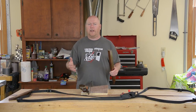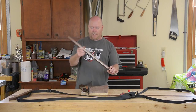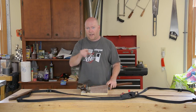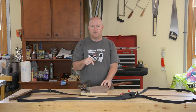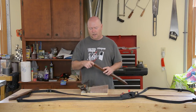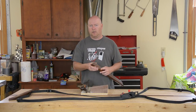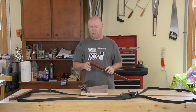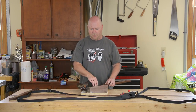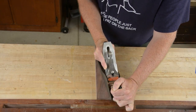They were ready to be glued up, but I decided to go ahead and finish them first. What I'm doing right now, before I actually glue this whole thing up, is taking these back to the shooting board and just taking one swipe across the end to clean off any finish that kind of bled over onto the glue surface, and also to make sure I'm back to a dead-square exact 45 after any wood movement issues from the finishing process.